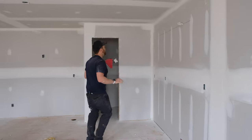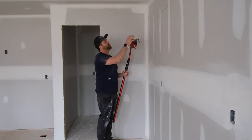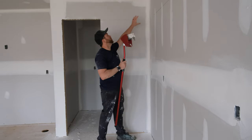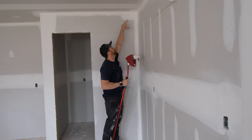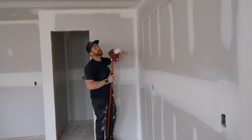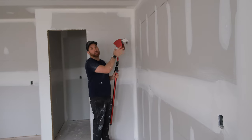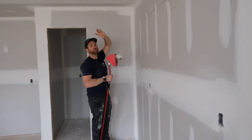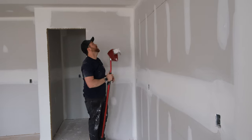Taking this to the wall — obviously you can only get so close to your inside three-way corner. You can see we've already touched up our inside three-ways a little bit. You can only get so close with your corner box and corner finisher, so after you finish your angles you always have to touch up your three-ways by hand.